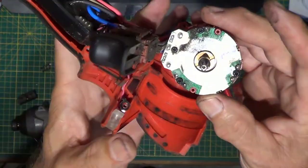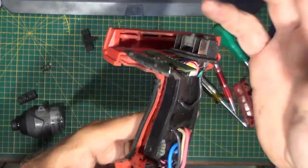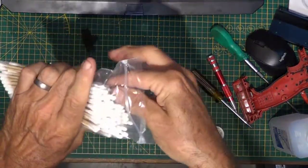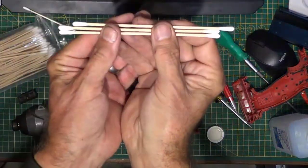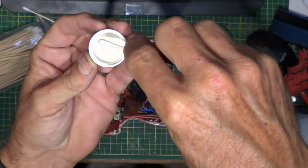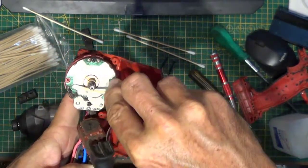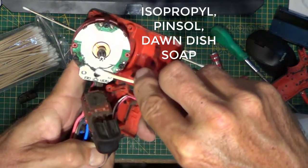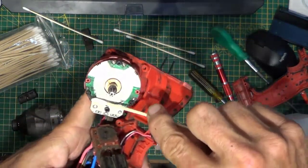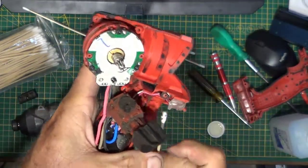Well-built machine — seems to be very robust, the case is good, I don't see any cracks, bearing seems nice, power control unit's nice — I'm quite impressed. Q-tips used for electronic cleaning, with a mixture I use for cleaning things — mostly isopropyl alcohol but there are some other cleaners. I won't bore you with the excruciating tedious cleaning process, but that's basically what I'm going to be doing — soaking it a little bit, brushing it, cleaning it, and then eventually soldering it. You can see this gunk is starting to come off now.